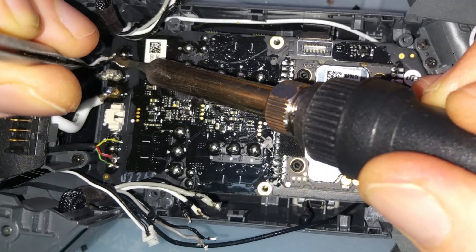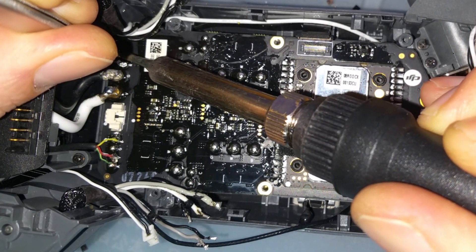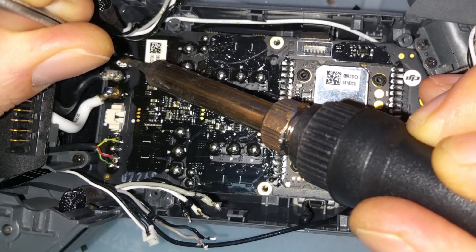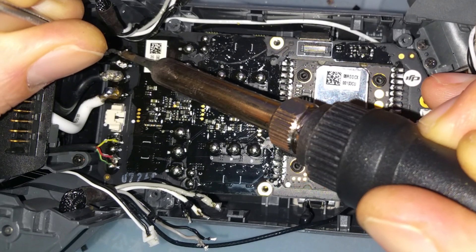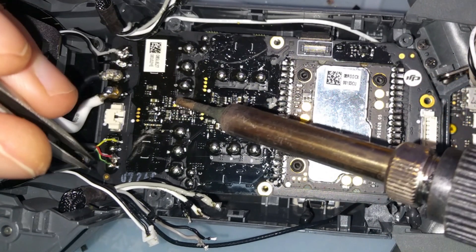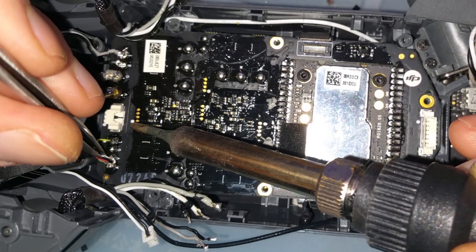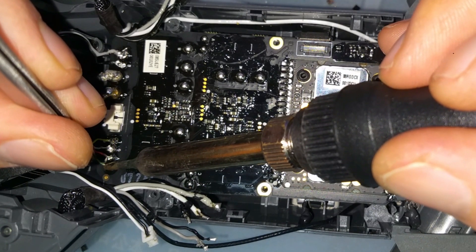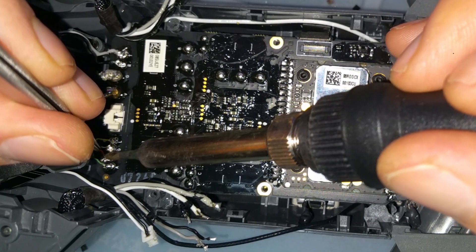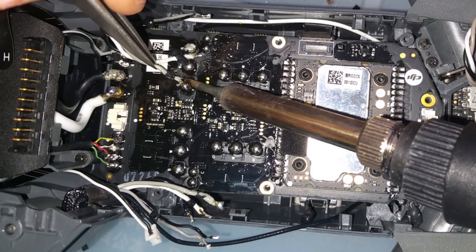Just solder every single thing on your ESC board back, and after that your ESC will work again. The reason why I replaced the ESC board on this one is damage on the back board. This drone had a huge crash when it landed on a tree and had damage on the back legs — they got bent. And once bent, the back legs also damaged the ESC board. For this reason, it was not possible to repair that board. I checked it — the board had a small crack on the side. I tried to make a connection, but the ESC error was still there. That's why I made the decision to buy a new ESC board, replace it, and everything is working fine after the replacement.